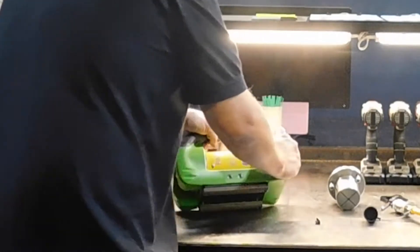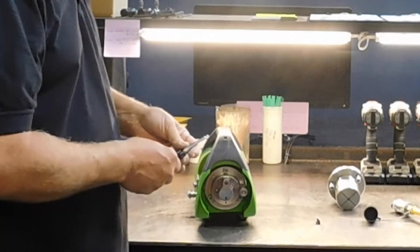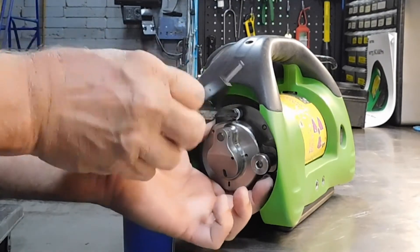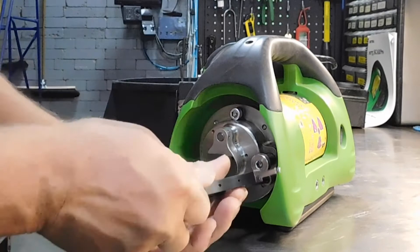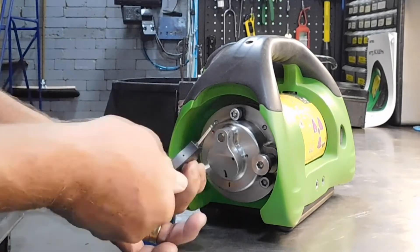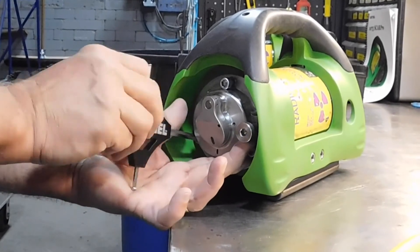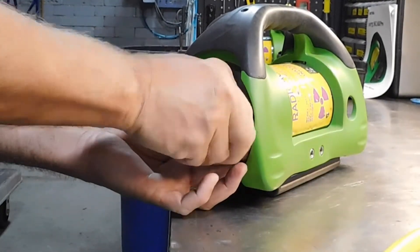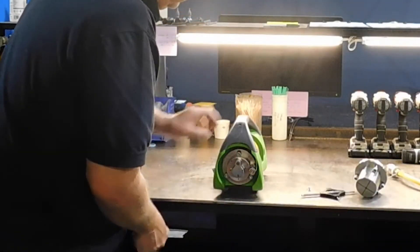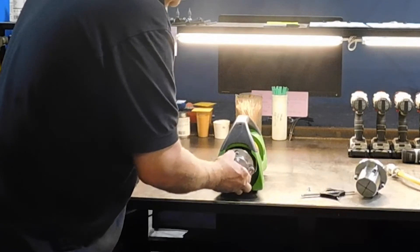Now the shield is closed. Rotate the camera over and grab your quarter-inch Allen wrench. There are three Allen head screws right here — I'll loosen them. These screws will not fall out of place once they're loose; they're indexed into the front plate — they're called captive screws. Now I've loosened the three screws, and I've also loosened the index pin, so now the plate can be removed.